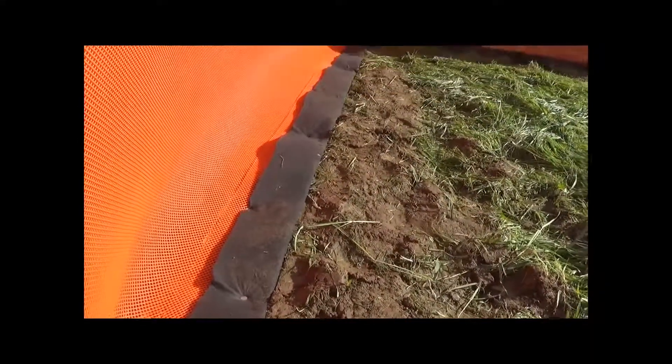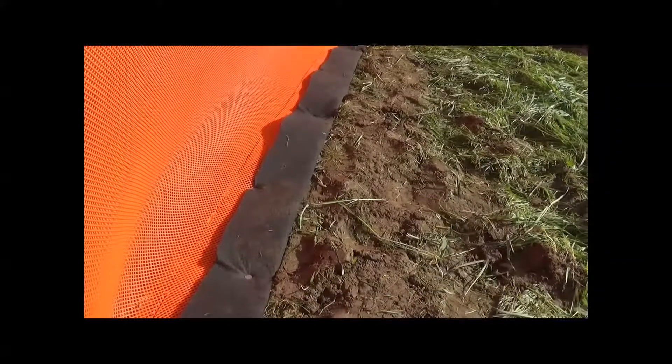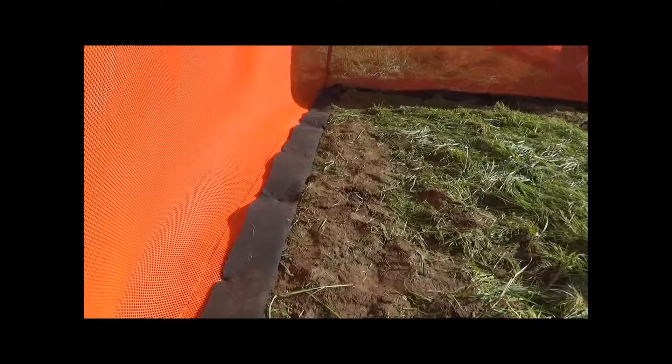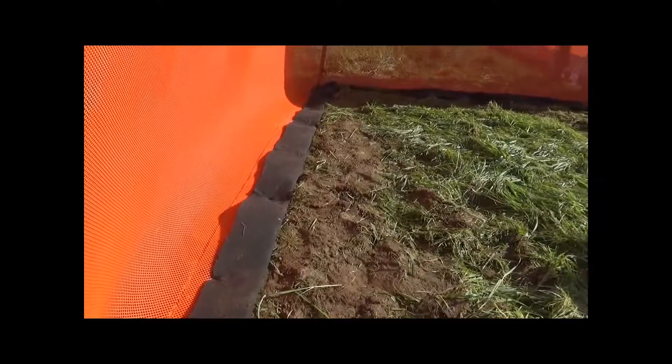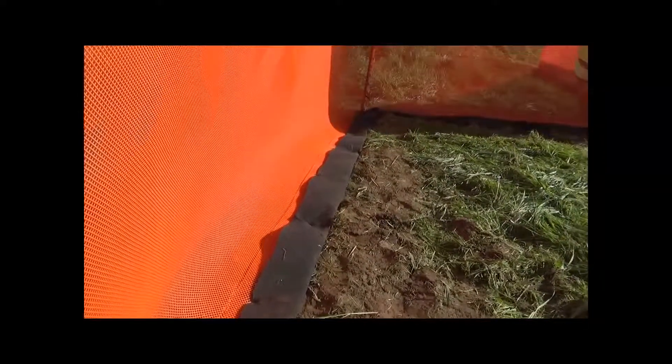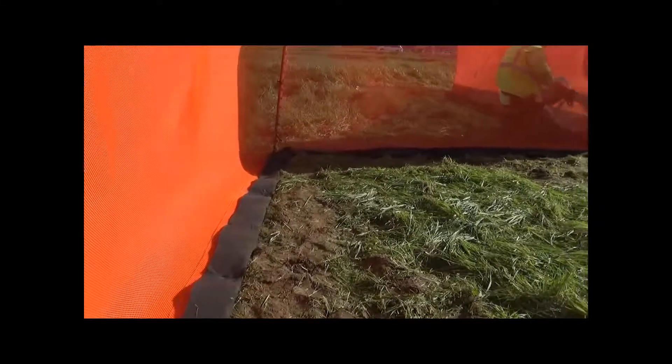If you want to install the nails in a zigzag pattern — one nail closer to the front edge, the other nail closer to the e-fence side — about two feet apart. After you've installed the nails, go back and check to make sure everything's taut and that you can't slide your hand or fingers underneath. It should be tight to the ground.